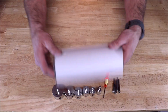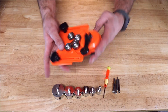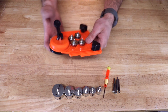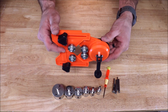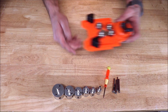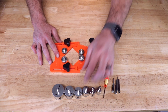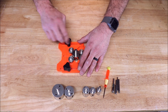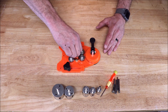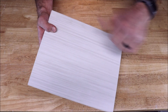Here is your suction guide to assist with your drilling — made of plastic with bearings. It feels just okay, but it definitely helps while drilling. You mark your spot, center it, tighten the two knobs, and then proceed to drill your hole. Let's get right to it and drill some holes in hard porcelain, ceramic, glass, thick quartz, and stacked stone to see how well it performs.